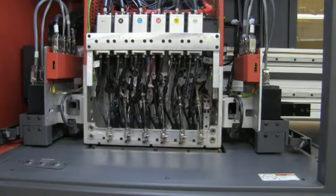Next in line, we have the first of two static ionization bars. They're designed to help mitigate surface static that can build up during drier winter months or when doing a lot of polystyrene printing. That surface static can cause some of your dots to go astray, leading to poor image quality. This is going to help control the placement of those dots by mitigating surface static.